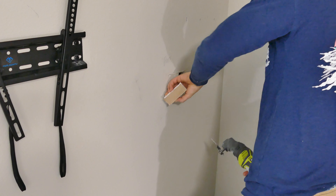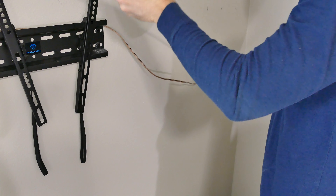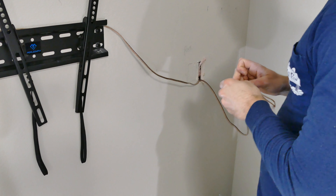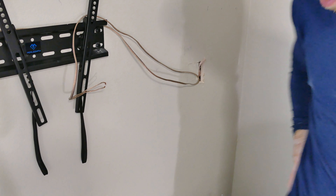It does need to be a bigger hole. I'm going to pull a plug out — you could save that little piece of drywall because you could use it to plug the hole back up later on and clean it up once you're moving out or decide you want to change it up. Now I'm going to feed the cables through using the wire feed — you can get these at Home Depot. They're relatively inexpensive and very useful for this sort of thing. Unfortunately this TV is being mounted on an exterior wall, so I have to deal with all the insulation in the wall.